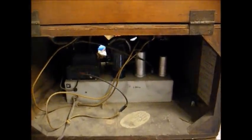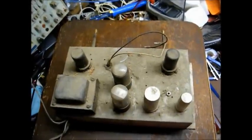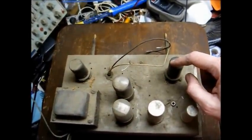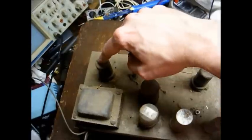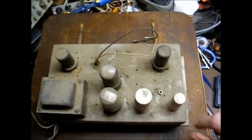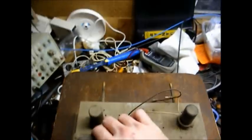Let's pull this amp out and have a look at it — we might actually start working on this today. Here's the amp out of the record player. This is our 5Y3 rectifier tube. This is our 6SC7, which is the magnetic phono preamp stage. It sends a signal over to the 6SQ7, which is the driver stage. Then our amplified signal comes out to the 6V6 power output tube, which is amplified to a sufficient level to drive the loudspeaker.